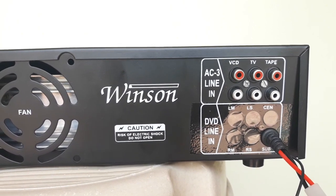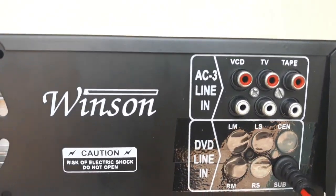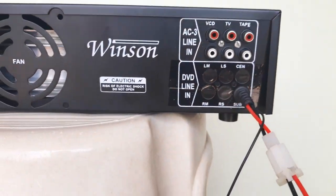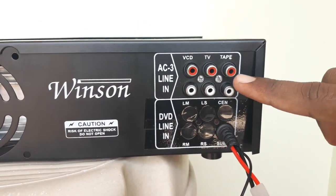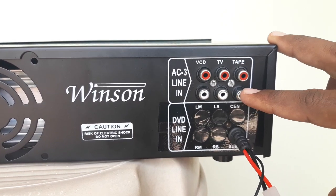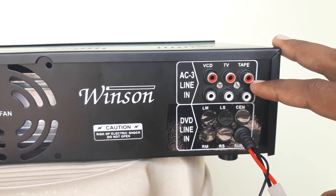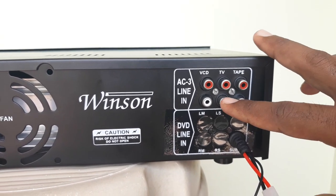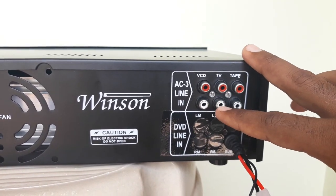If you see the next section, here is the AUX input and audio pre-output. I connected here. You can see the two tape connections marked there — it has a pre-output. So we get the USB kit audio output and connect this to the main amplifier. The AUX input switch is what we have to select.